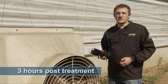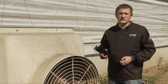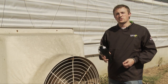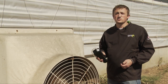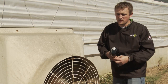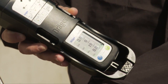It's been three hours now since we treated the pit and did our initial readings. I'm going to use the Draeger meter and the tape here to do a parts-per-million reading of ammonia in the pit and see what MTM has changed over that three-hour period. I've done two readings in the last 10 minutes and it looks like it's between 15 and 19 ppm — significantly lower than our initial readings of 23 to 27 ppm. Verifying with the tape, it's sitting right at 19 ppm, still significantly lower than what we were looking at earlier.